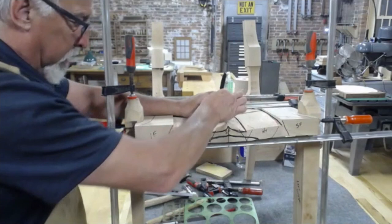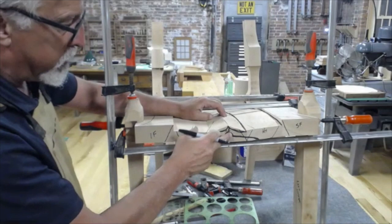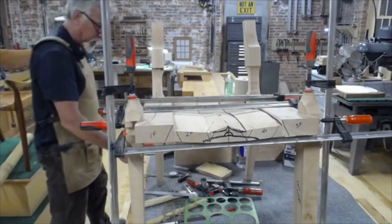And then once I have this shape, I file, and I'm over-exaggerating this, I file a round-over like that from the front to the back of that 6 inches on the underside. If you feel on the underside of this here, that's what that is. And so it's just taking a file, or you know, I've done this in the past, if you've seen these things.